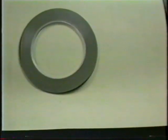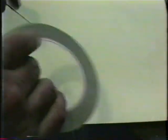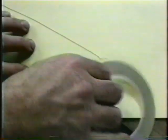And no finishing discussion would be complete without a little primer on tape. This is 3M fine line tape. It's light green. And this is 16th. You can see it comes in strips. It makes nice edges. It's got the right stickiness to it for doing trim. It peels up relatively easily without peeling up the paint. Anyway, be aware, not all tape is the same.